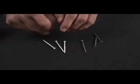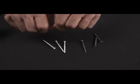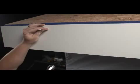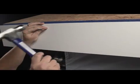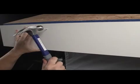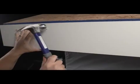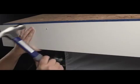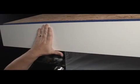The nail should hold a minimum strength of at least 12 gauge. VERSATEX requires the nail to penetrate a full 1.5 inches into the substrate. Galvanized nails can be used, but we find stainless steel works best to avoid bleeding, especially if the product is left unpainted. For best results, always fasten at least 2 inches from the end of the board.